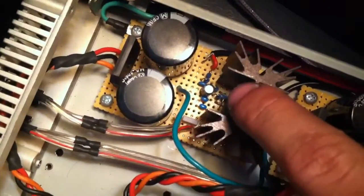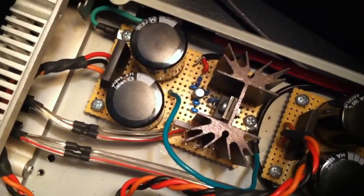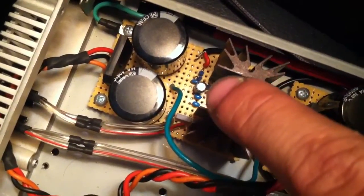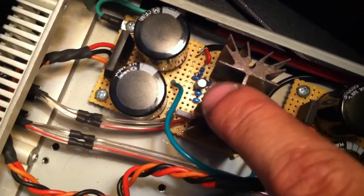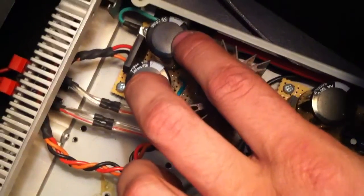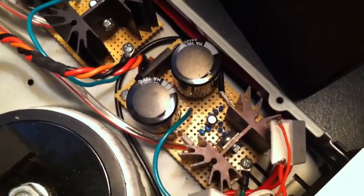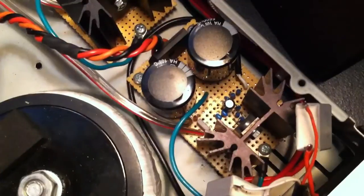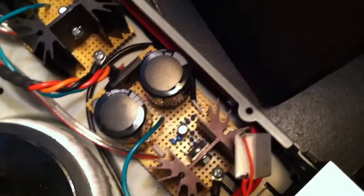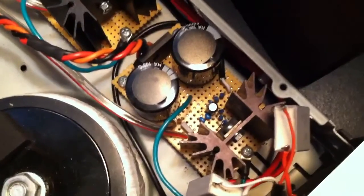You can see all the components down there. I used plus/minus 1% tolerance resistors, and I used an FR series cap from Panasonic for the feedback circuit. I used Panasonic TSHA series caps for the power supply filtering. The ceramic caps are all from Murata — that's how you say it, I think. And then all the resistors are from Yageo, or something like that.